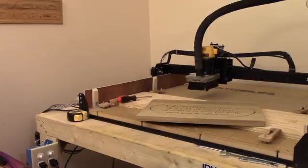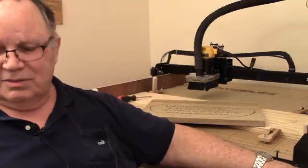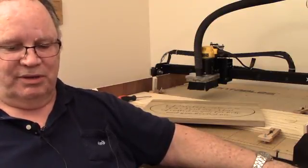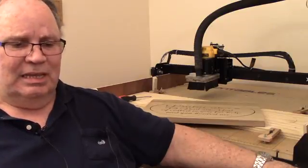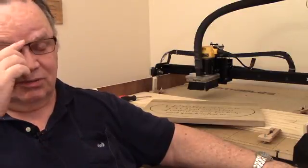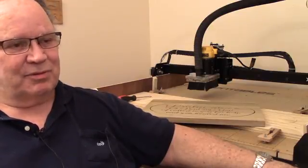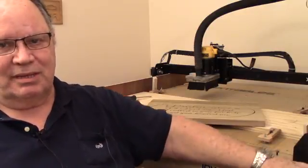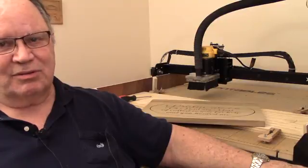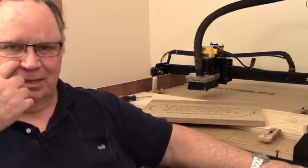That's the end of the carving. And I was looking at my other board that I did that I messed up for the third time. I can only assume that when I run those through my thickness planer, you get snipe on it, and I know you can avoid snipe by running a board through before and a board after, but I didn't have any boards of that thickness to run it through, so I just ran it through and figured, well, I'll sand the snipe out. And I did. It sanded right out. The only problem is using an electric belt sander. I think I probably got a little carried away there in that one spot. That's the only thing I can figure, and I sanded down a little too low. And consequently, I ended up with what I ended up with, a poor carving.